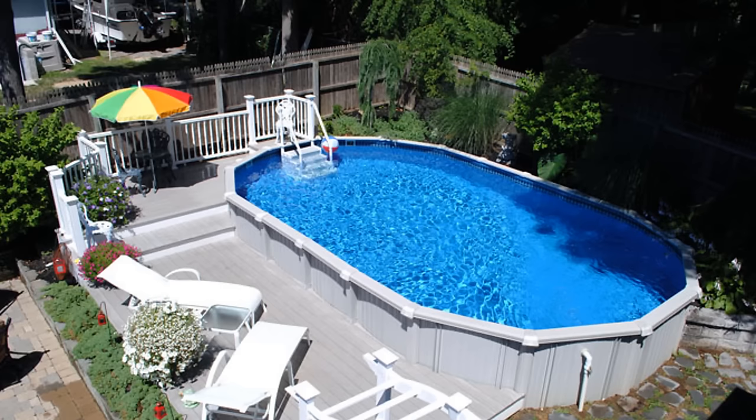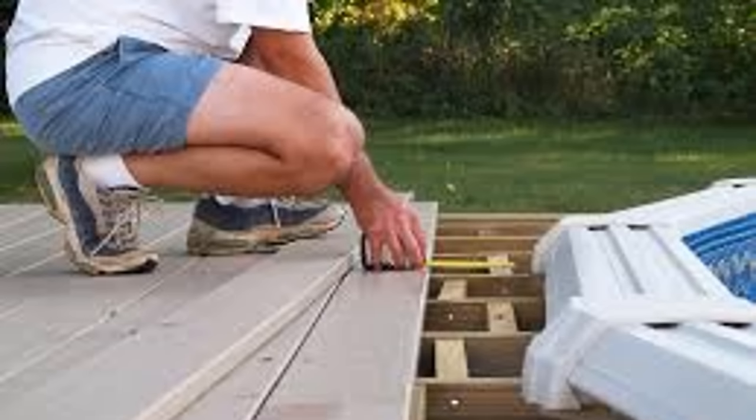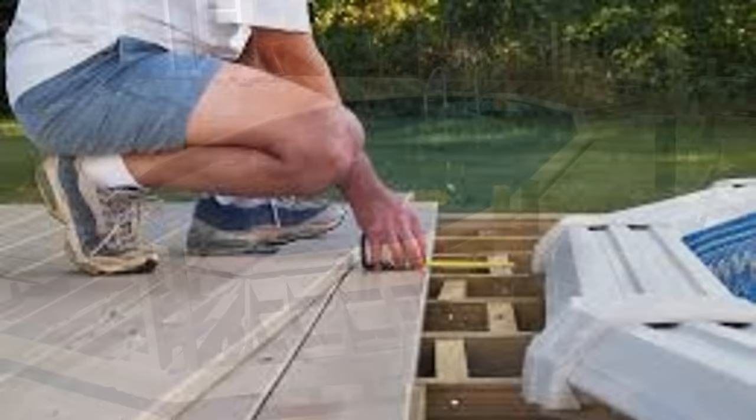If you're looking for an instant deck, then aluminum or resin is the way to go. Composite decks have been around for about 30 years. The composite materials nowadays are a major improvement from the initial materials — when composite was first used in pool decks it would warp and the screws would jut outward. Now composite decks are smoothly built and do a great job of handling weather changes. Another option is to build a pressure-treated frame and then finish the rest off with composite materials.